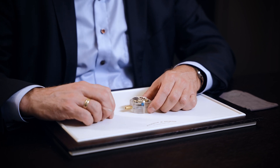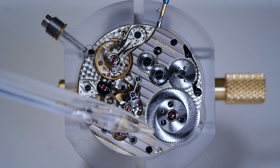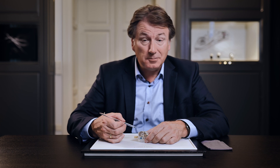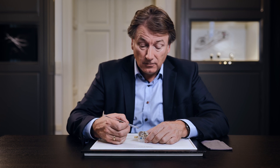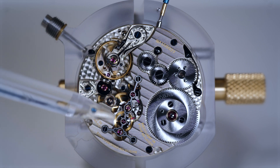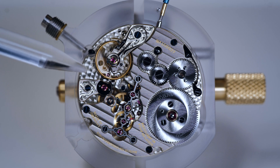Caliber 043.6 — that's the caliber number of the new Zeitwerk. Let's take a close look. Here we have the twin barrels, although you only see the upper one here. It's a patented system and in fact one of the six patents of this watch. We also see the remontoire system, which provides its power to the escapement. And there is a beautiful balance spring with the Breguet overcoil, well hidden underneath a hand-engraved balance cock.